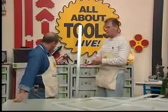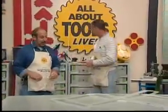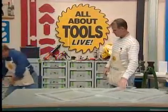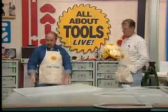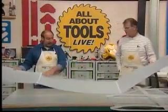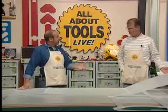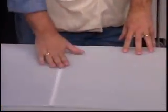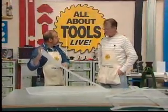Now I know you wanted to talk about the templating material. Before we get into the templates we made, this is how the material actually comes. What's nice is these are packed 15 pieces in a box, and they're scored in two places so you get three sections per piece. It's 28 inches wide by 120 inches long, so it's really perfect for countertops. This can be used in a strip method, a solid method, or a solid method with strips. If you order in quantities of 100 or more it comes unscored, but to be able to UPS it, it comes scored — and the dimensions don't change whether it's scored or not. You can see through it, which is really handy.